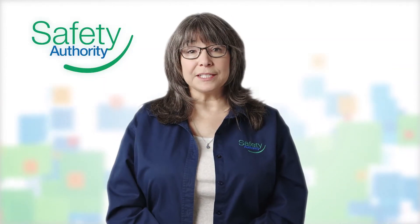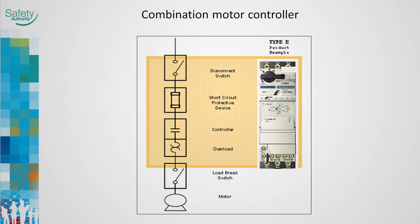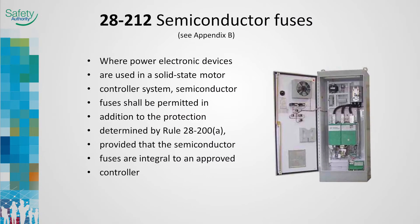The components are selected, assembled, and tested as a combination unit. The advantages include reliability, smaller size for a given horsepower rating, and a modular unit which has an overall short circuit current rating higher than the lowest rated individual product. These units can be mounted on a DIN rail. Special endurance and short circuit tests ensure a coordinated combination starter that will clear a detected fault and protect itself from damage. It is the only category of combination starter that a designer can easily identify as self-protected, due to the required self-protected combination motor controller product marking.